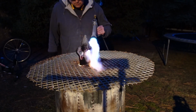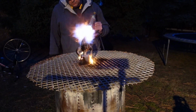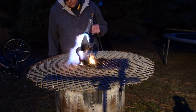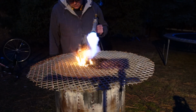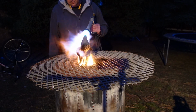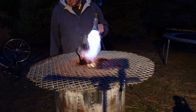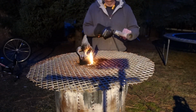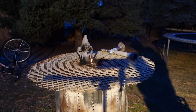HellFire is great at avoiding cracks to some degree, but it does have its limitations. So start from the bottom up, work up to the top of the piece, melting the wax out. And we're also not looking at this point to completely vitrify the ceramic shell of HellFire and the suspended slurry. We're only looking at burning out all of the wax. We don't want to get this thing glowing hot red. That's not our purpose on this part.